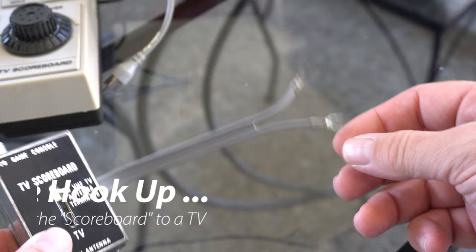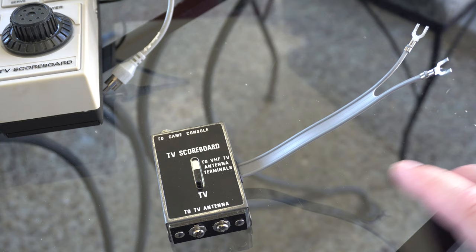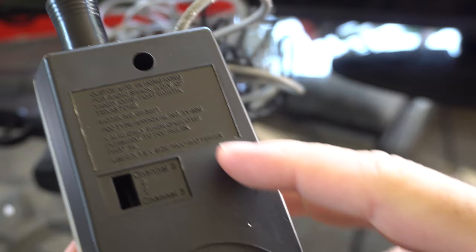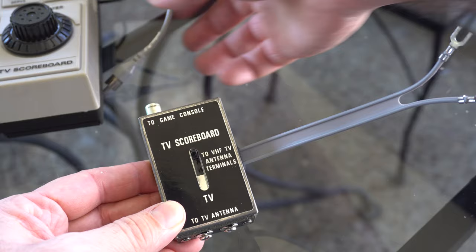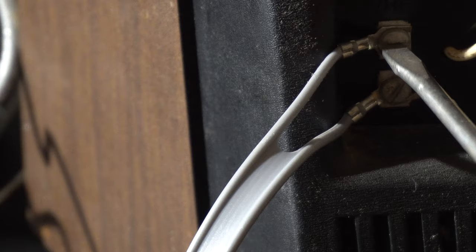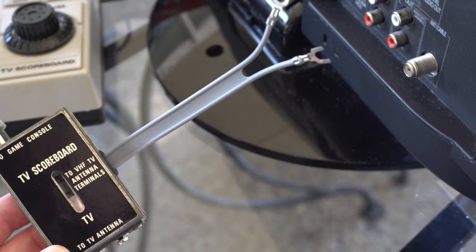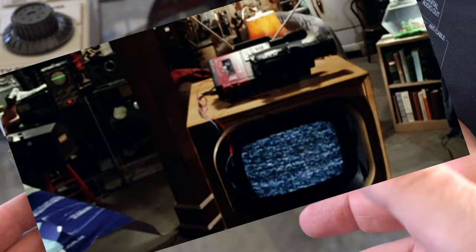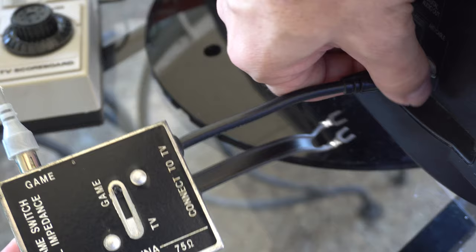So when you're playing Xbox with your friends, you're doing it usually on a TV, right? Yes, and also on phones. Well, this is a typical style TV game switch of the 70s and 80s era — it would be used for Atari and Intellivision or those kinds of things. Much like a VCR, the TV Scoreboard puts out a signal on a VHF channel. You connect it to the top and to one side of the switch and the antenna on the bottom. The output has these lug wires, which would work great on an old TV. But eventually we switched from those to coax. So how am I going to connect it to this more modern coax connector on this flat panel TV? I happen to have this switch which actually has both 75 ohm and 300 ohm connectors on it, so it is compatible with a flat screen.